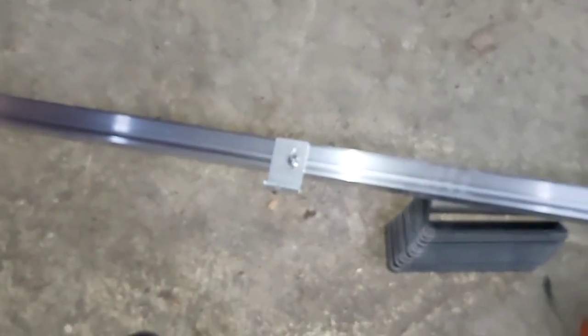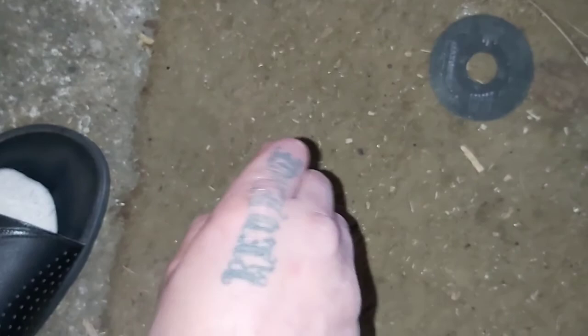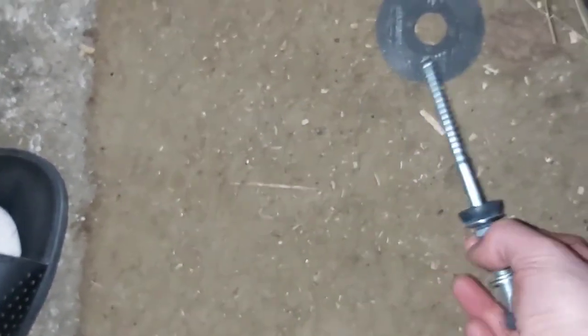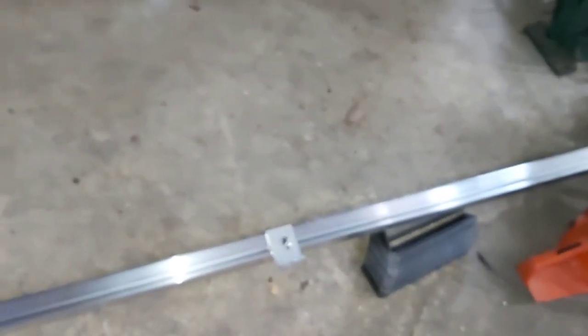Only going to do one hole. I'm also using silicone. Once I drill a pilot hole to make sure I'm close to my mark, I fill the area in the hole with silicone, and then I put this through and sandwich it and smooth it out around the edges. You want it to be as flowing as possible. There will probably be some precipitation going through that area, but I think it's turning out really nice.